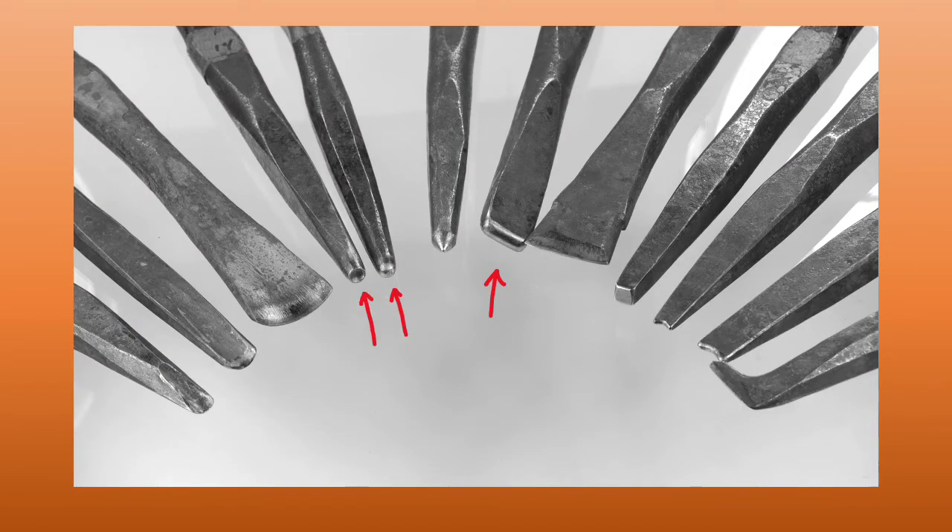For the tools required: we're going to use the general fuller, and then I have a ball tool that's about a quarter inch OD, and then I have the eye socket tool which is about a quarter inch ID. I actually use this OD ball tool to help shape the eye socket tool. The first thing we're going to do with the bear's head is use this ball tool to clean up the eye socket.